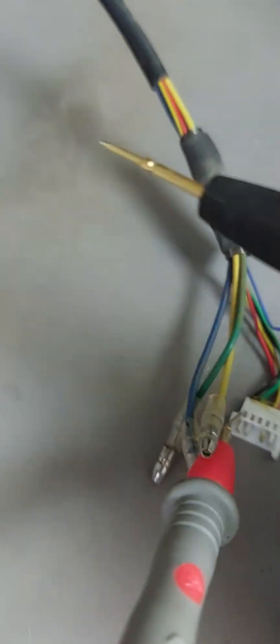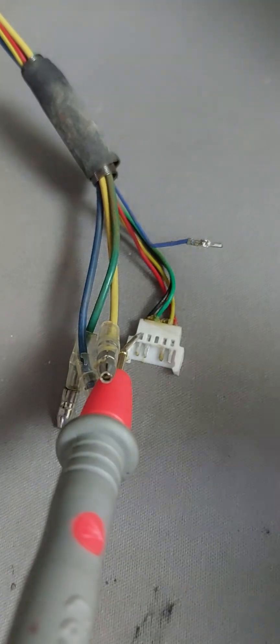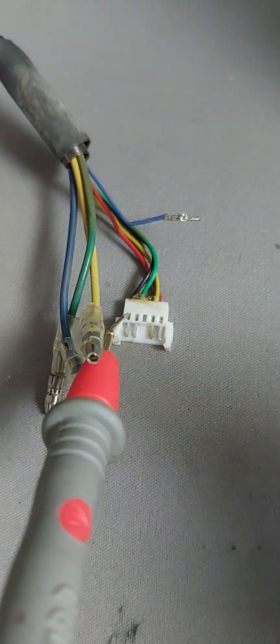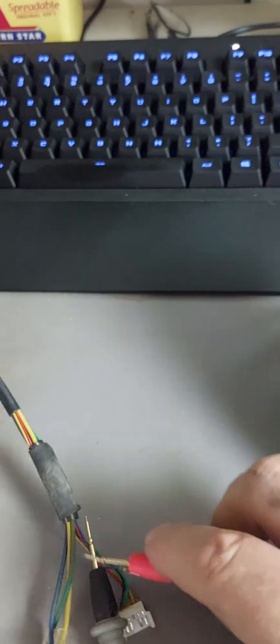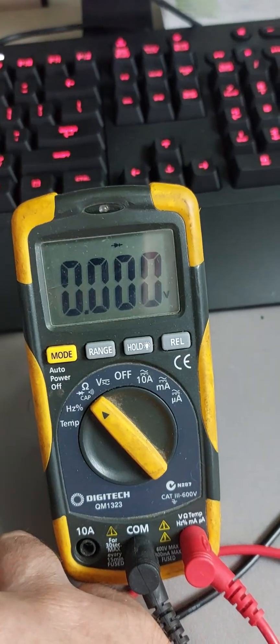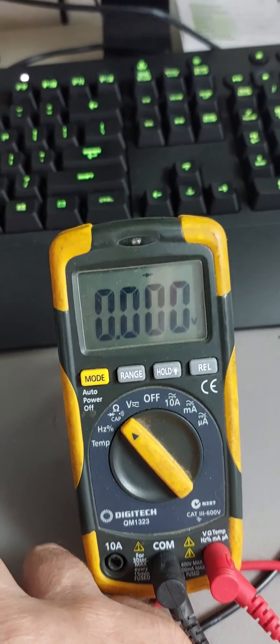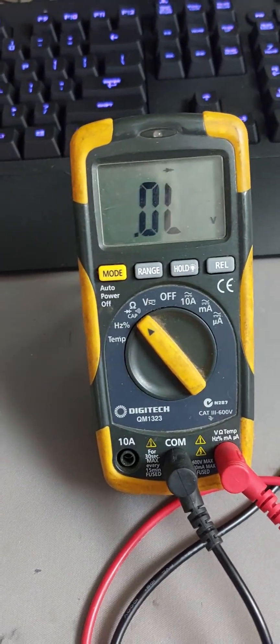If you do that and you're getting around about 0.5 volts — could be 0.6, 0.4 — that's fine. If you're getting an open circuit, that would show as OL on the meter, which is outside the limit. If it comes up short or drops down — you'll notice it goes to 0.9 then drops to 0.8, 0.7, etc. — that means there's a problem. But doing what was suggested first is the best way to determine the condition of your hall sensors.